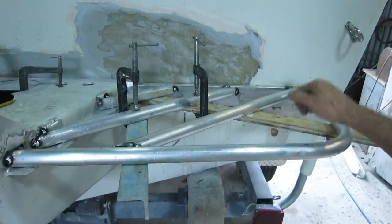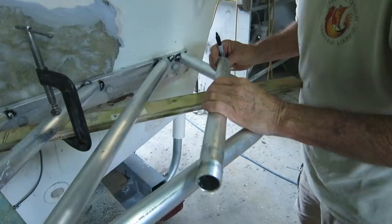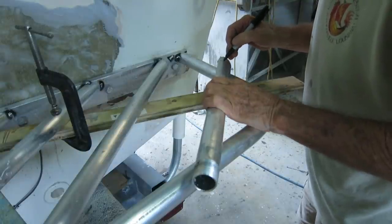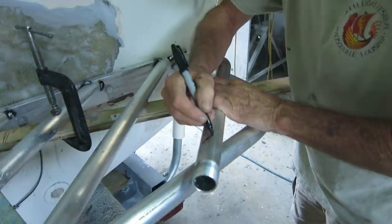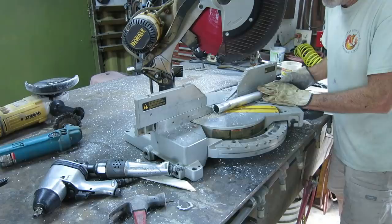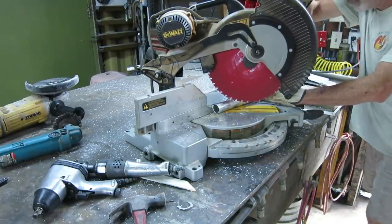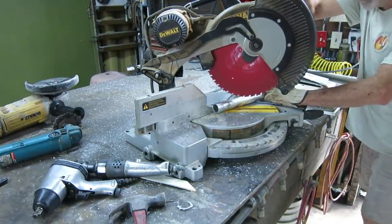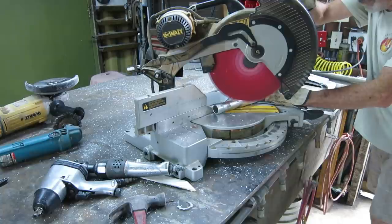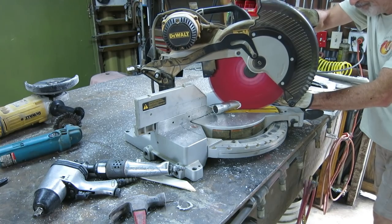Getting all scientific here — I'm trying to make this pipe parallel with the last pipe. I'm marking the center of the external tube — that's where the edge of the notch needs to be — and marking the inside too for where I need to notch it. Being a cheater: my saw won't turn more than 45 degrees, but if I pull the other end away from the fence a little bit and hold on tight, I can get a sharper angle than 45 and get it pretty close. Sometimes it yanks out of my hand and makes ugly sounds, but most of the time I get a pretty good cut.